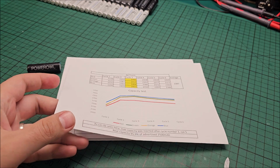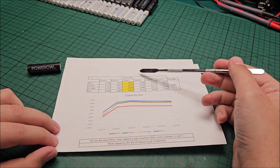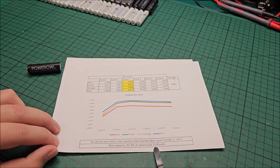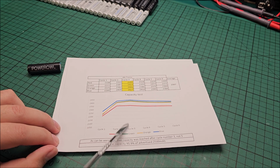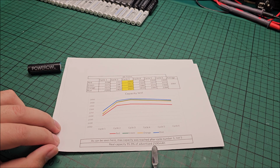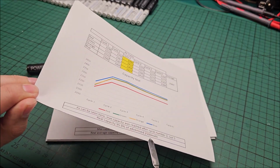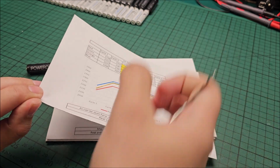In comparison, I will link a video in the description where I tested some Tronic cells from Lidl, AAs also. Those things average at 95.9% of advertised 2500 milliamp hour. Much better. And although I did not really like these cells too much because they still lied a little bit, they had about the same values as the old cells, which they actually advertised at only 2400 milliamp hours. So they bumped up this number, but the cells themselves were testing about the same as the old ones. Well, that kind of shows us that numbers sell. So they needed to put a higher number on the cells themselves for people to grab them off the shelves.